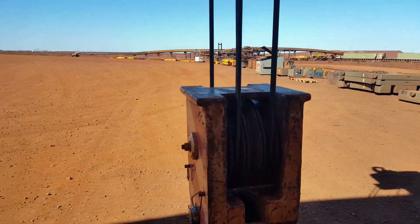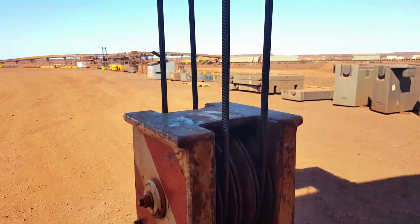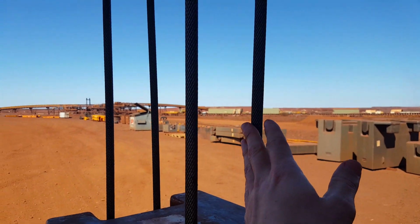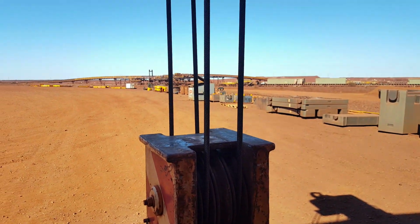Guys, let's just establish what we've got here. On the Franna, we've got 4 falls on the hook, okay? These are falls, just parts of wire, parts of line. 1, 2, 3, 4, all right? Let's just establish that, and I'll meet you up the back.